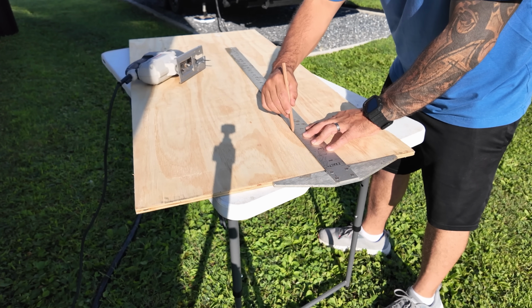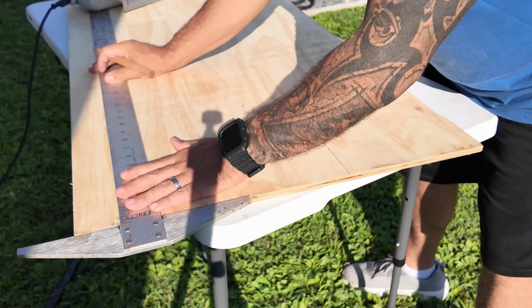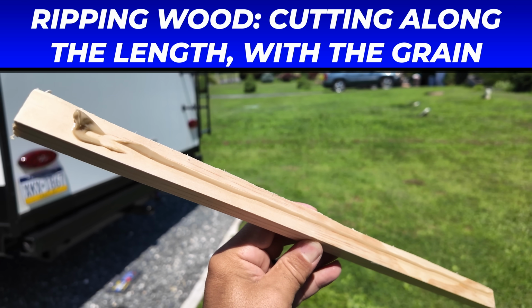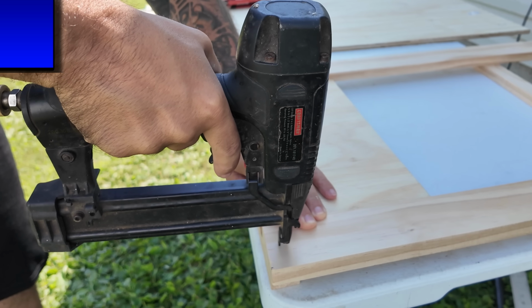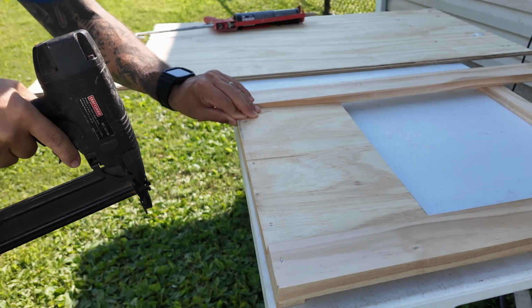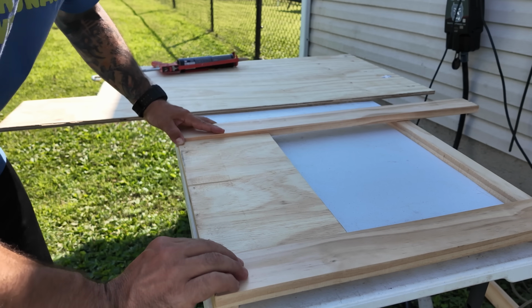The highest part of these pipes is about 6 inches from the floor, so I made my middle piece 8 inches tall. To connect these 3 pieces together, I just ripped a piece of the 2.5-inch pine, added some wood glue, and placed that support on the rear across all 3 pieces. I then ran a couple of staples through to lock everything into place. Yes, for those of you paying attention, you will notice I already forgot to go through the back, so I'll have to putty over these staples later. I did remember after joining these pieces that I should be going through the back, so we're going to go through the back for the rest of the modification.